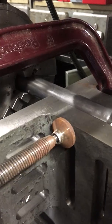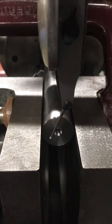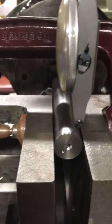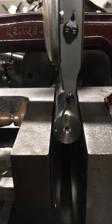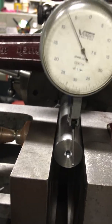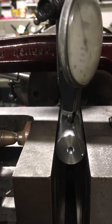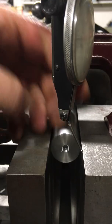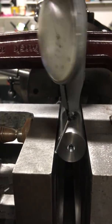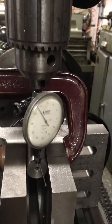Now what we do is bring the clock down. It's got to be above the job because if I were to wind it round it would break the needle off on that side. That was just lined up by visual eye, so I move it what I consider to be half the error, wind it round to the opposite side, and go half the error again. So now I can bring the clock down on the quill, inside the job.